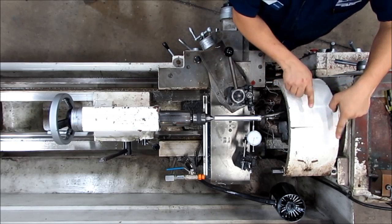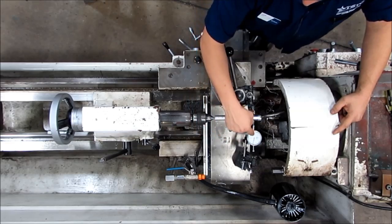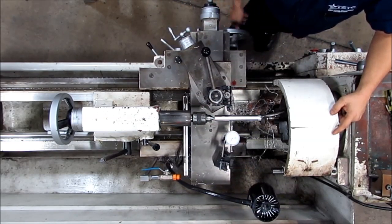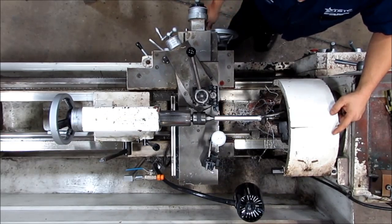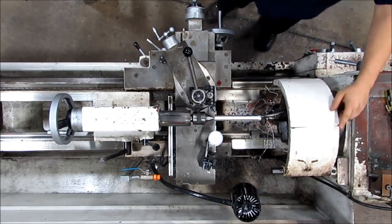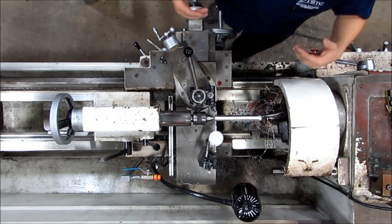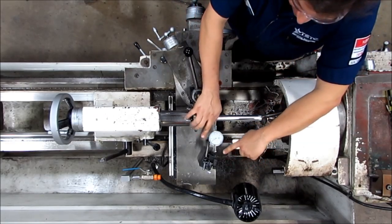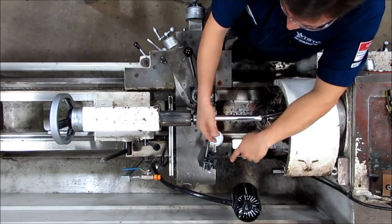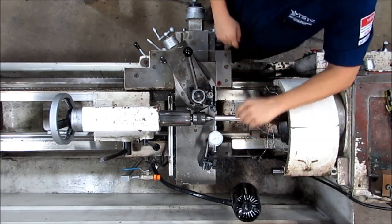The reason I start at the headstock is when I adjust the tailstock, I want to be down at the tailstock side. So I always start at the headstock and bring it down. I've taken this way out and I'm at about 12 thousandths out total. So when I do that, I need to adjust it halfway. The sweet part about this setup is I don't have to do any math. If this is a positive 12, I want it to end up at a positive six.